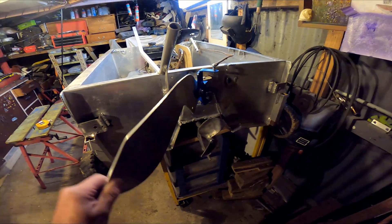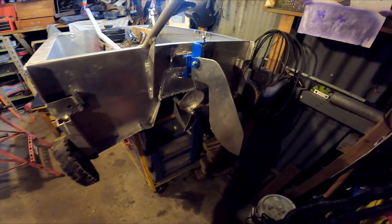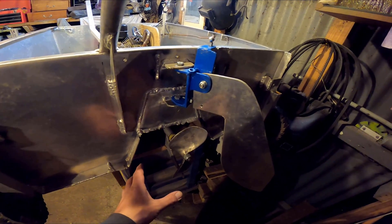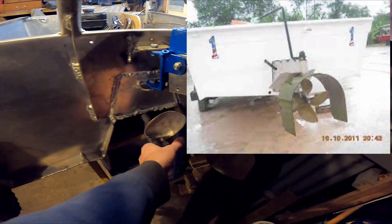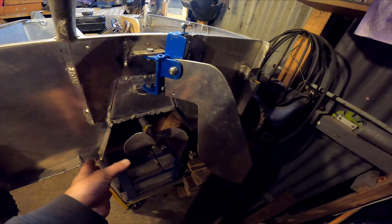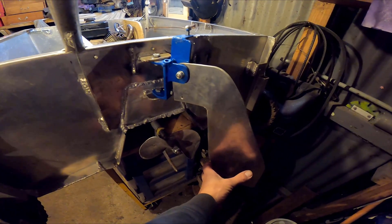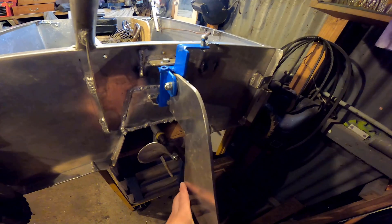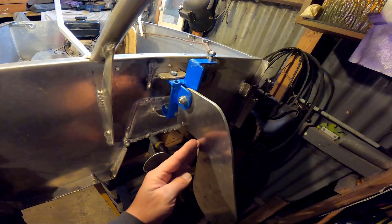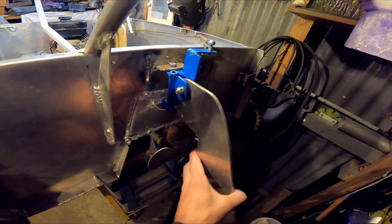Hi guys, Daniel Kazenis here. In this video I'm sorting out the tunnel hull inboard surface drive — fixing the exhaust and fixing the rudder. Last time the rudder was steering terribly and swinging out of the way of the prop wash. People suggested a levi drive, but I tried making a cowling for the propeller once and it really reduced its speed. What I've seen is if you put the pivot point at the leading edge of the rudder, or even a little bit back, that seems to work — so that's what I'm going to do first.